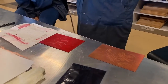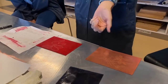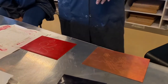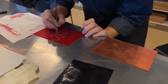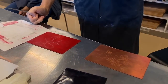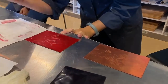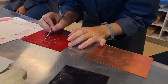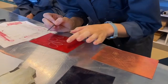You don't have to press very deep because you don't want to scratch the copper — you just want to remove the ground, the red stuff, so that when it goes into the chemical it can eat it. If you scratch really hard and change your mind and don't like a spot, it's already scratched in. Otherwise, you could paint a little drop of ground on a mistake, and then put it in the chemical and it won't eat that spot. If you etch it lightly you can etch it again later.